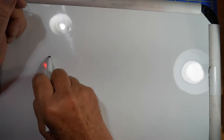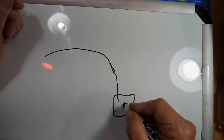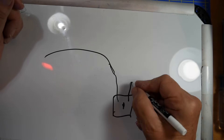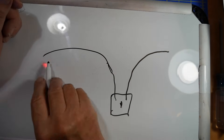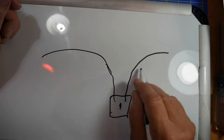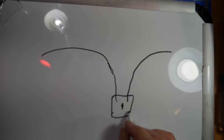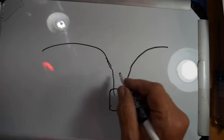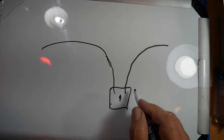That knob-and-tube stuff is long gone. You're going to run Romex all the way to the switch, then out of the switch to the device — none of this wire-crossing issue — and you have both the hot and neutral in the same cable. This also allows you to install timers and dimmers that you can't do with the old knob-and-tube structure without creating problems.